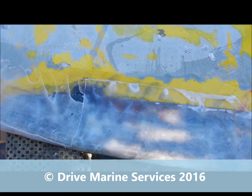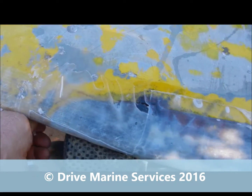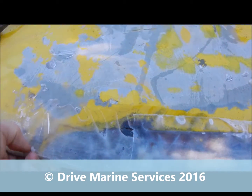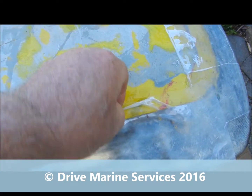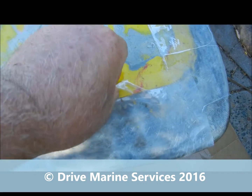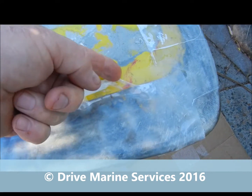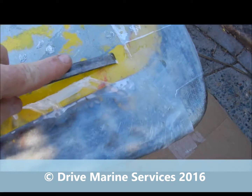Once you do that, it's a pain in the neck to pull off. I just want to rip it off but it's coming off in small pieces — it's going to be really hard to get this peel ply off. Where it's lifted here, unless you're careful when you pull along, it's just going to rip in that spot. And where it's buried here, unless I can get the chisel right under that edge, I don't stand a chance of getting it up.